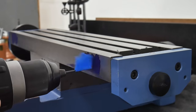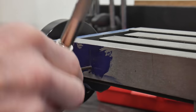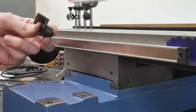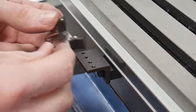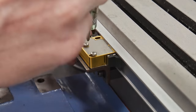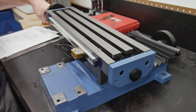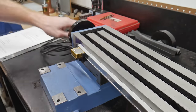I used a piece of masking tape to mark my drill depth — this worked very well. Once these holes are drilled and tapped, you can go about attaching the magnetic scale to the x-axis with the two provided M3 10-millimeter pan-head screws. Depending on your mill you may also need to drill some M4 holes into your saddle to attach the reader. The Little Machine Shop 3990 mill already has these holes drilled and tapped. The rectangular block standoff and L-bracket reader mount can then be installed on the saddle. The reader head sits in a thin caddy that has two chip plows on both ends to protect it from debris. From a spacing perspective, you want the reader head to be a hair away from the magnetic scale, but close enough for the rubber plows to touch the scale.